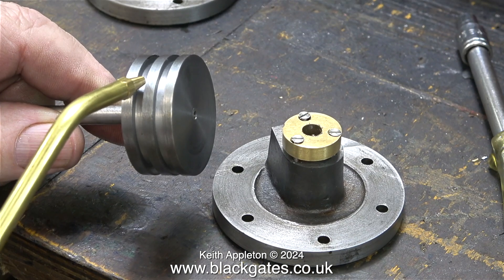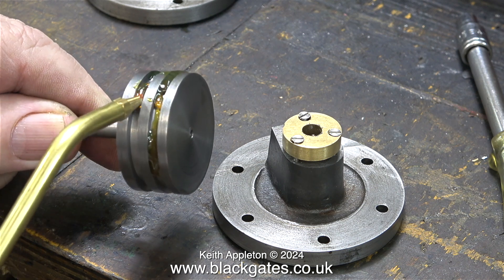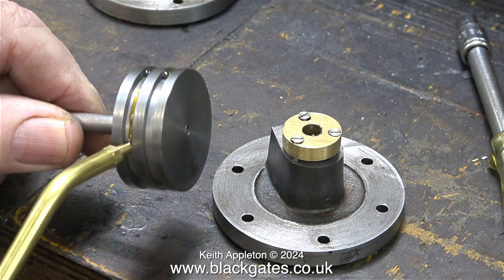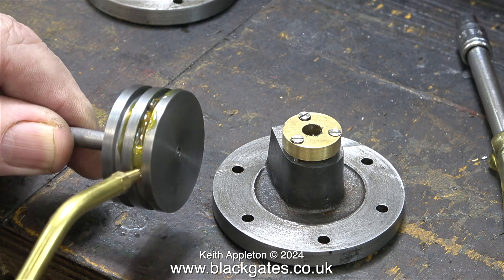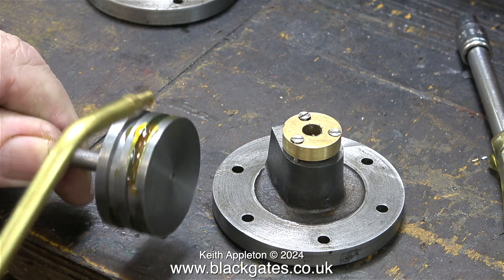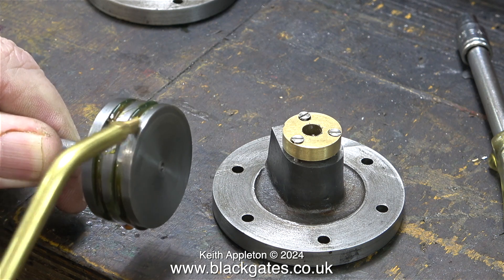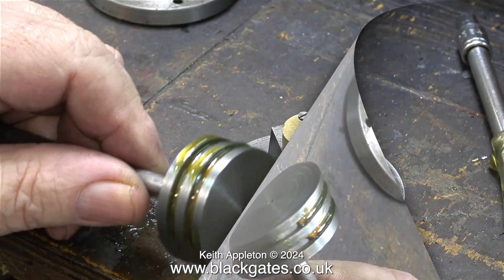There are many different ways to fit cast iron piston rings to pistons. The grooves are perfect and I'm using a lot of steam oil — why steam oil? Well, it's really good stuff to use; it's an extremely high-grade lubricant. As you stretch out the piston rings to go over the pistons, it's quite important not to snap them in half, so you need a delicate touch for this job.